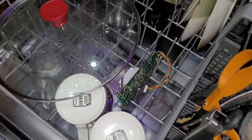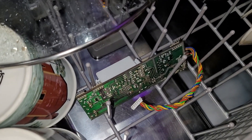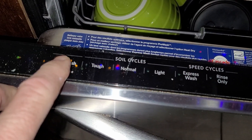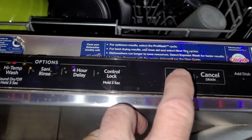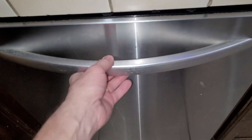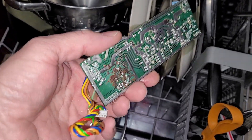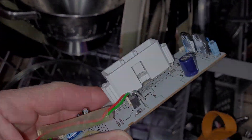I'm going to go ahead and place the board down here in the dishwasher. It's going to clean all the electrolyte off the board and everything should be as good as I can get it — maybe not like new, but very close. I'm going to select the pro wash cycle with no heat and no high temp. Alright, dishwasher is done. Much, much better — look at that. No electrolyte. It's all washed off.